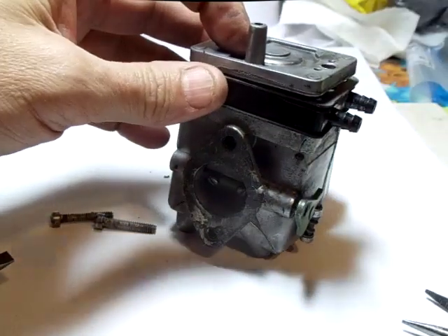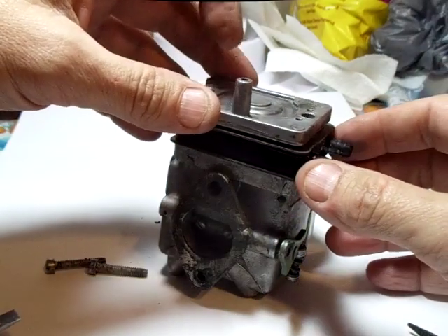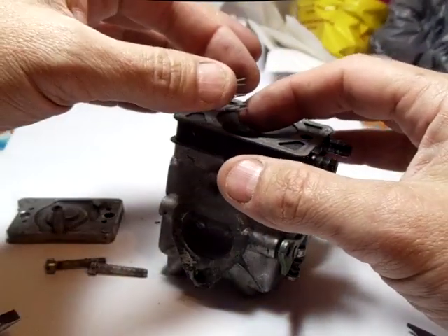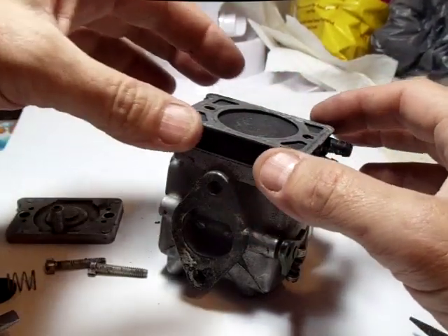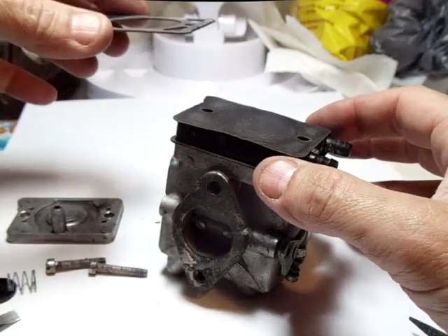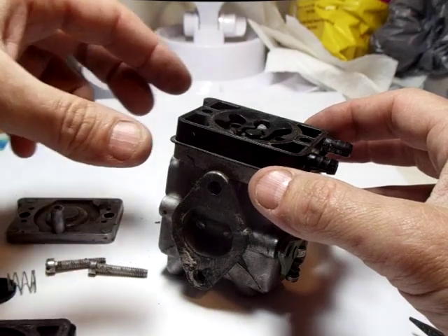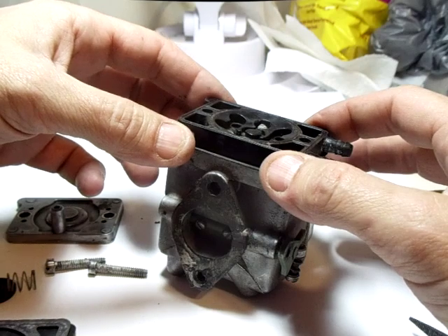So there's multiple layers here. You can find the manual online to know the order, so I'm going to point out the order for the gaskets. I'm going to lift this top cover off. You see we've got the spring onto the tab — you have to press onto the diaphragm. Note that the diaphragm, according to the Onan manual, is positioned below the gasket. Those gaskets come off; this one's already been off — it was not working. I fixed it. I thought I'd show you how I did it without having to spend $100 on a new fuel pump kit.